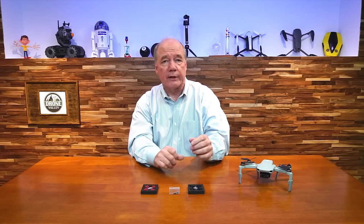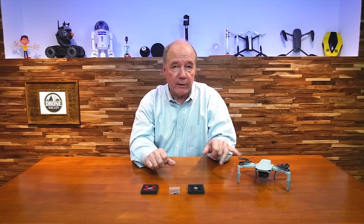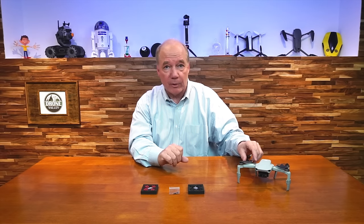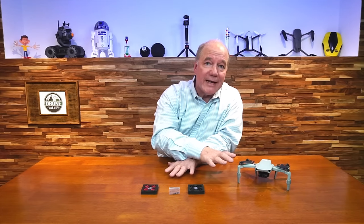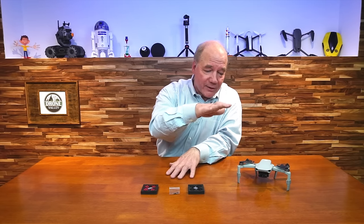I'm going to show you next how to install them, just so you see how simple the process really is. I'm not trying to sell you motor covers — we offer these on the website but you can find them all over the web. What I'm trying to do is caution you that leaving a motor open, whether it's the Anafi, the original Mavic Mini, or the Mini 2, is really just looking for trouble long-term. As an engineer, debris getting in there that shouldn't be part of that mechanism is never a good thing. These will help keep all that debris from finding its way down inside those windings, because gravity is not your friend. So stay tuned — next I'll show you how to install them, then I'll come back with some final thoughts.